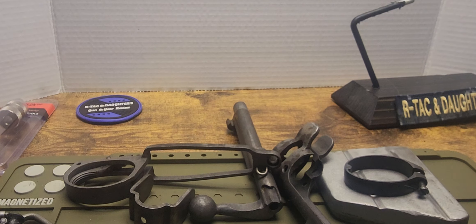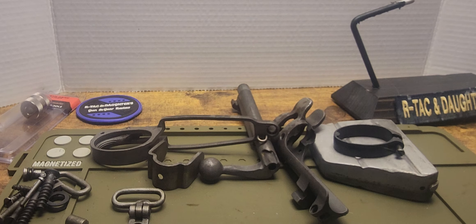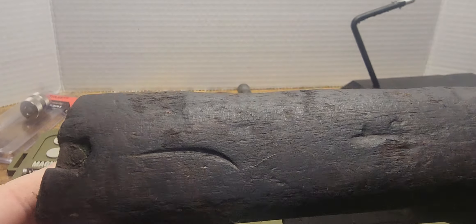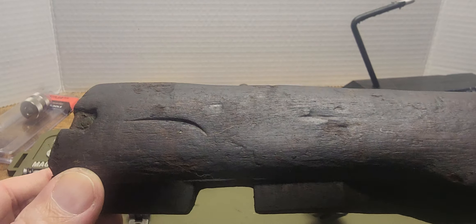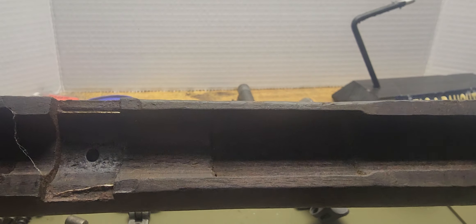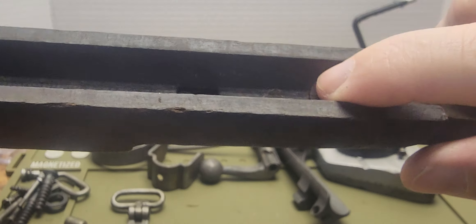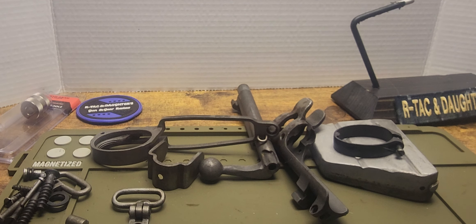I still got strong rifling in it. I'm going to get the rifle and show you some of it. Some of the bluing on it was salvageable — I didn't have to restore it. So this gun is technically not restored, it's basically just cleaned. I'm probably going to wash the stock with Dawn next, and then protect the metal parts and paint them after they're cleaned, then lubricate them, so I don't have to worry about them rusting underneath.